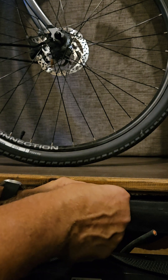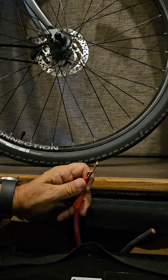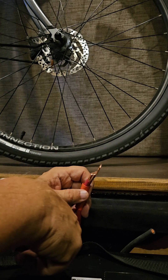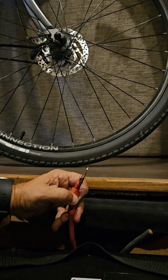So that's it. Effectively, if it says 25 on the package, that means use the 25 setting. But they also said you can use one size smaller — so in this case it would be 16 — to make sure it's crimped down real good, and you can do it several times. Well, that's what I learned from this. Hope you have a great day, thanks for watching.